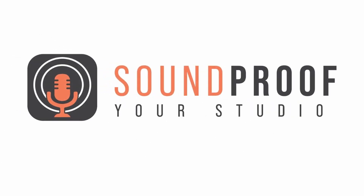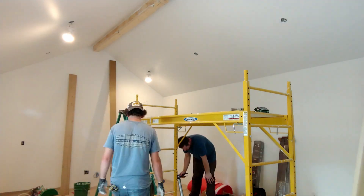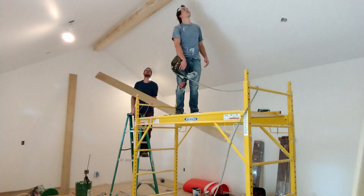Let's jump into the lesson. First, let's start with a general overview of how to create a soundproof beam. We're using the same concepts as we've used in other situations. We're still going to use two layers — in this case, not drywall, but two layers of plywood with green glue in the middle — and we're going to wrap it around the existing beam.